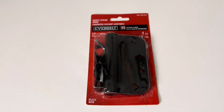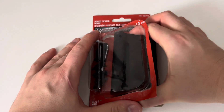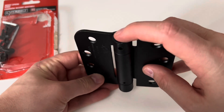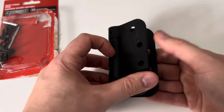You may see this hinge on a garage door, on a furnace room door, or sometimes on a door separating two units in a duplex or a triplex. Self-closing hinges are noticeably different than the standard type of hinge you'll see in residential construction. An easy way to identify them is the center portion between each side of the hinge does not have a pin that can be removed to separate the hinge — it's one solid unit.